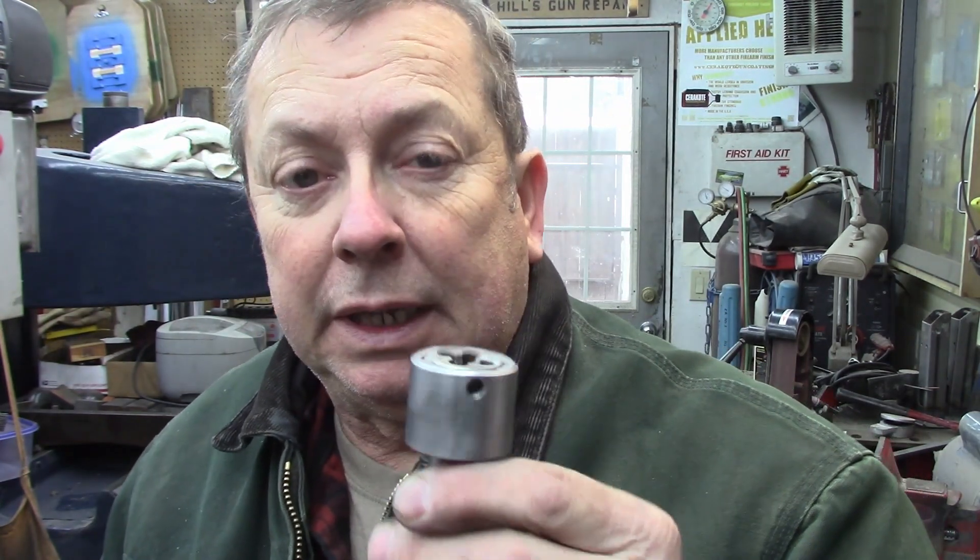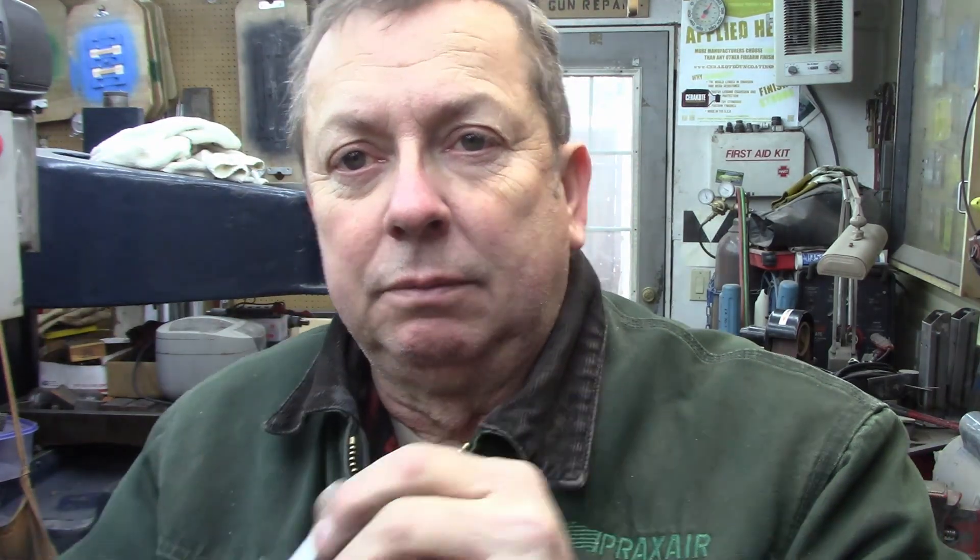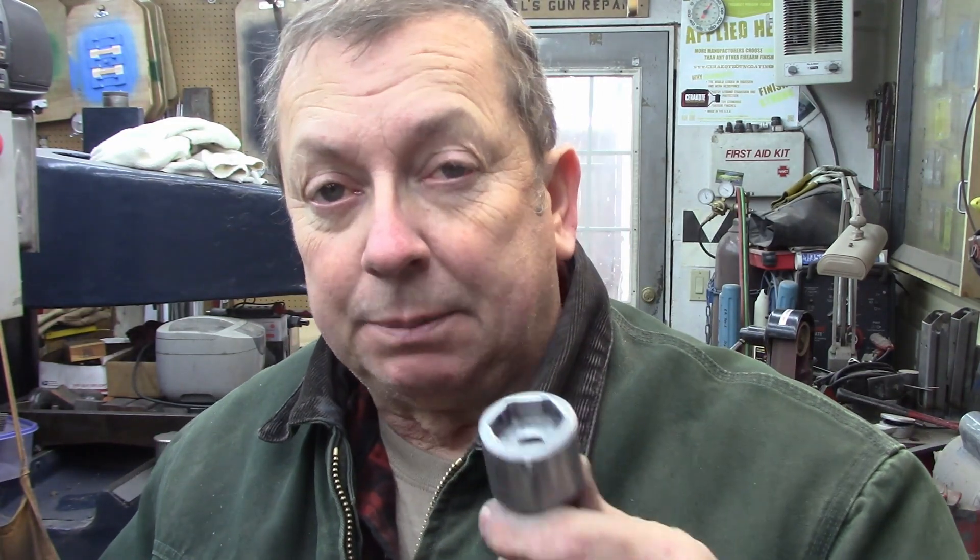For me right now it's about availability of dies — my local tool store stocks hex dies, that's what they stock. I can run down there and buy a hex die anytime I want. They cost about less than four bucks a piece — I think that's what I paid for the last half dozen I bought from them just the other day as I was setting this up. Consistency — I can always run a nice sharp die. The advantage of a split die is a little adjustability in how tight or loose my threads are, but for this application I think hex is the best way to go.